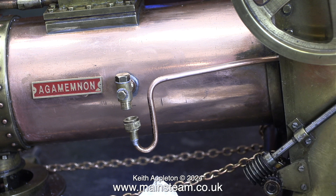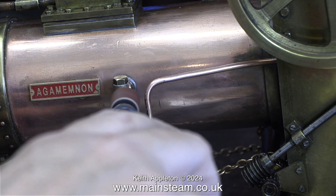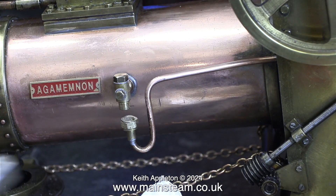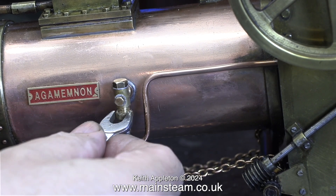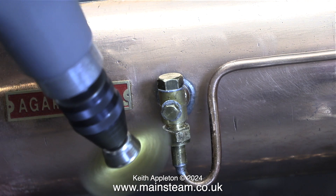This traction engine is no more than a large steam toy because of its construction, the materials used, and the fact that it has soft-soldered major components. What I'm doing here is using a drum sander in my Proxxon motor tool to shorten the union nut, which was just far too long. And now when I tighten it, it doesn't bottom out against the bottom of the check valve — instead it holds the union cone very tight.